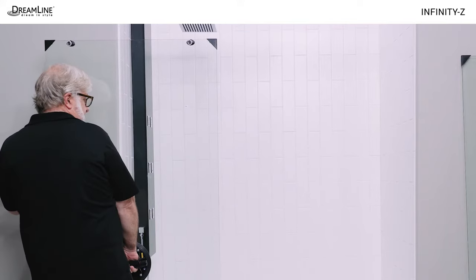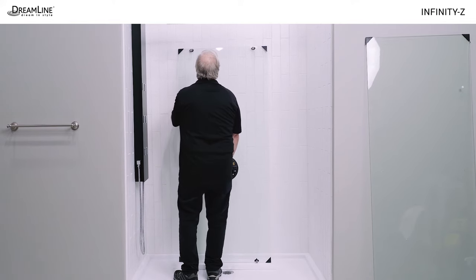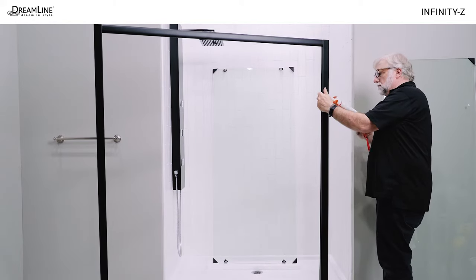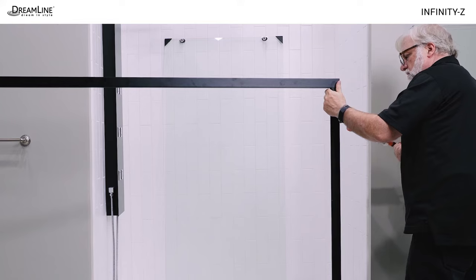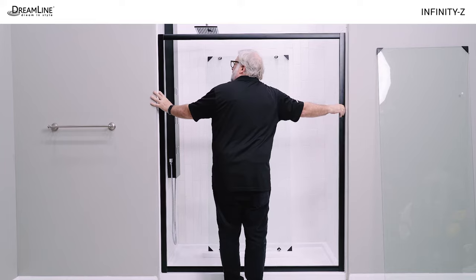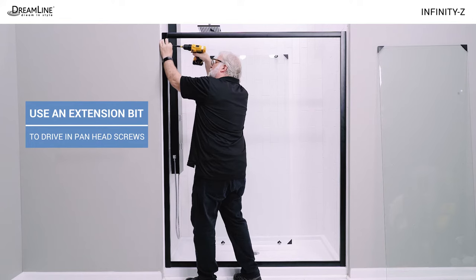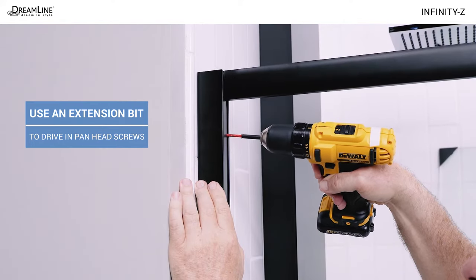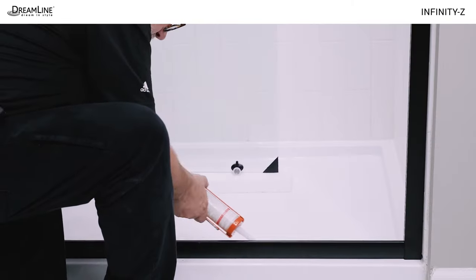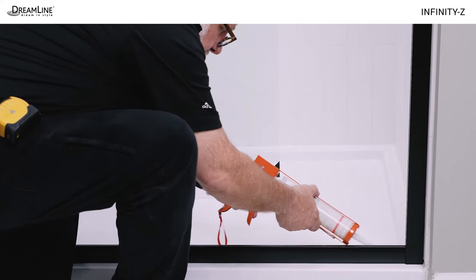Place the door glass into the shower area. Use protective padding and leave the corner protectors on to help prevent any damage to the glass. Apply silicone to the backs of both wall profiles and the underside of the bottom rail, then place the frame back on the marks made in the opening. Check that the profiles are plumb and that the bottom is even from the threshold edge. Use an extension bit to drive the 2 inch pan head screws through the holes in the glass profiles and secure both wall profiles to the walls.